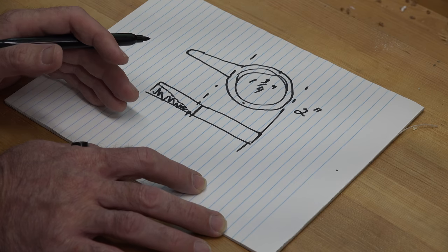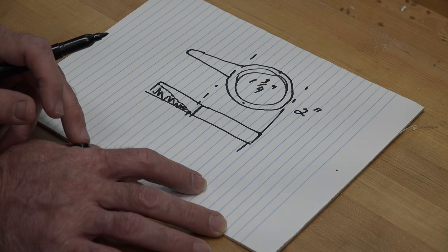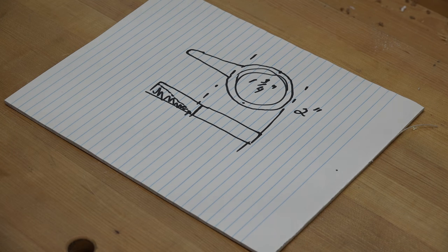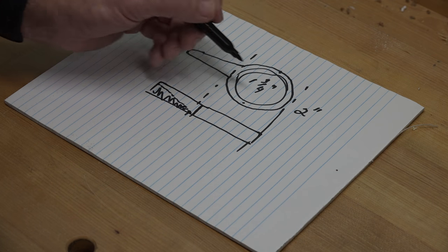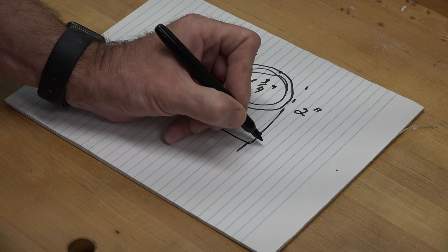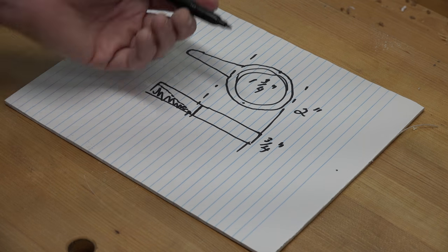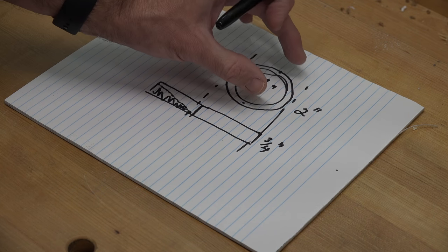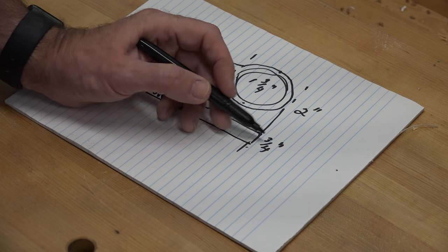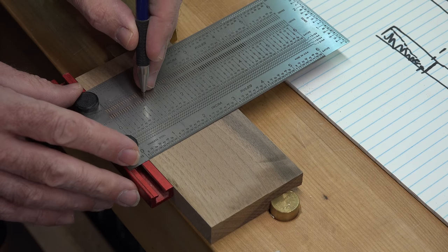But the first thing we're going to do is choose our material. I'm going to head over to the wood rack over there and see what kind of scrap pieces I've got hanging around. One thing that I neglected to mention is if this hole is 9/16 of an inch thick, I think we're going to go with a minimum stock thickness of 3/4 of an inch. So that's what we're looking for, a piece that's at least maybe 2 inches by 3 inches possibly, and 3/4 of an inch thick. So our scrap piece of walnut here that we found on the rack,